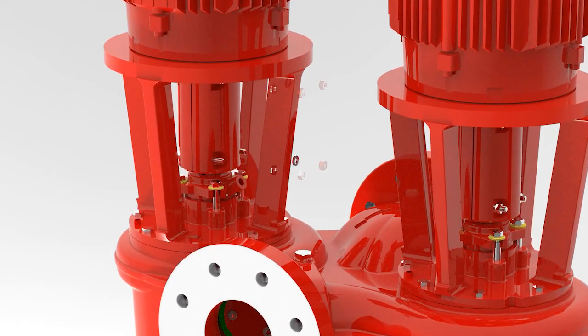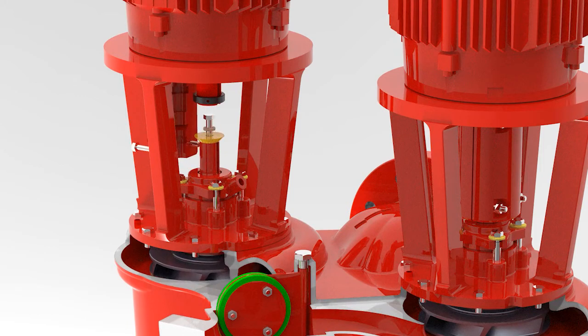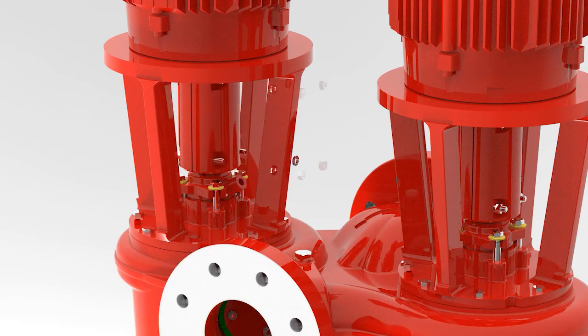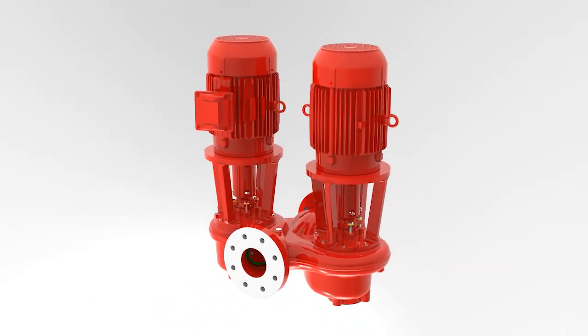To access the mechanical seal, the coupling must be disassembled. When the coupling is disassembled, the impeller and shaft drop to the bottom of the volute. After service is complete, the coupling should be reassembled. During the reassembly process, as the coupling halves are tightened, the tapered washer rides up into the angled groove, lifting the impeller from the bottom of the volute back to its correct height.